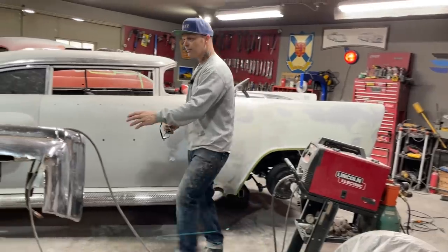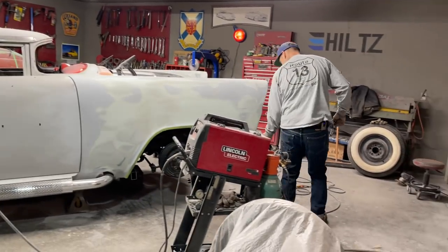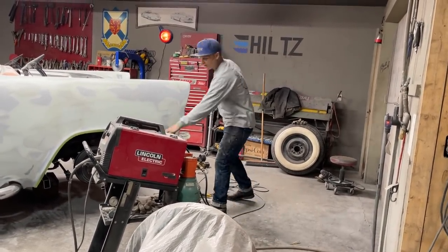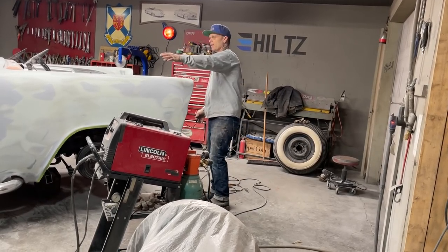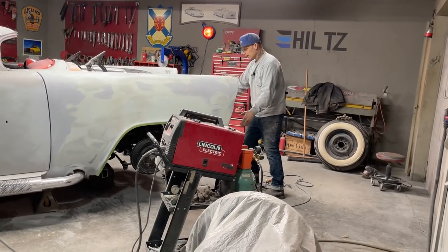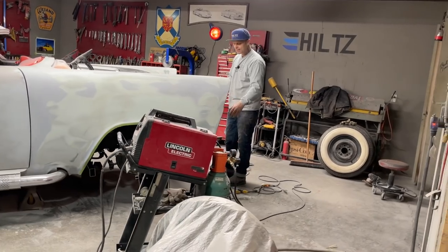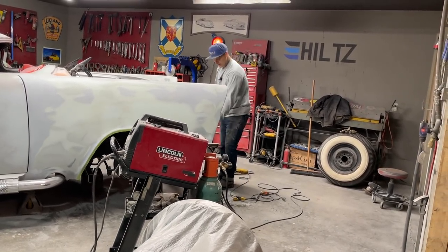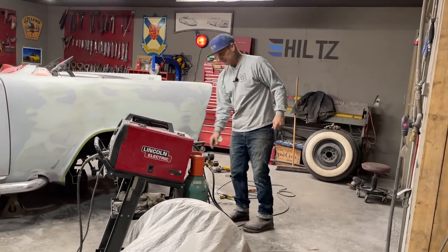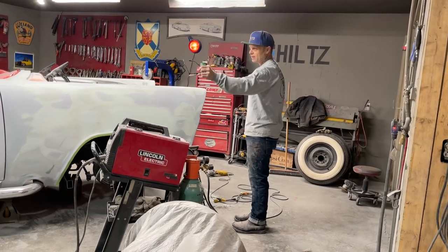But when it comes to fitting a bumper on a car, I bolted it on the car in a fashion where I was able to make it fit tight. It was so hard to make the bumper fit really tight to everything by putting it on the frame and going that way. I didn't have any brackets. So I figured out welding the bolts on this and then tightening the bumper to this, and it really made it fit really nice.